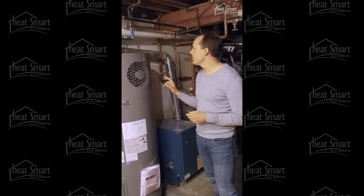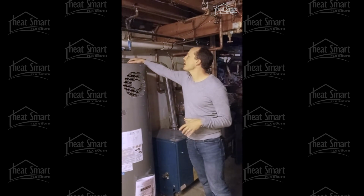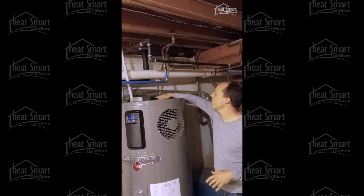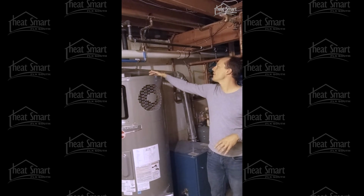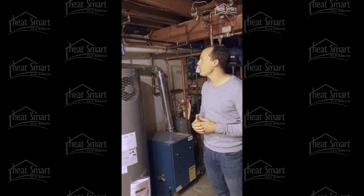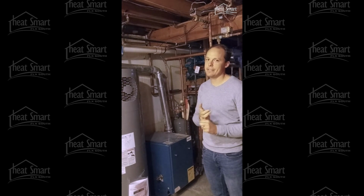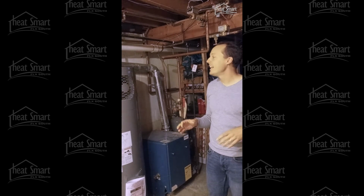Yeah, so the unit really needs ample space, so that it's drawing air from the top up here. Here's our filter up here. It's drawing air from the top, and this is the outlet. So the hybrid hot water heating system wants to draw in warm air. That's how it works most efficiently. So you want to have it in a space that's big enough and a space that's warm. So you can't put it outside, you can't put it in a garage, especially in New York.